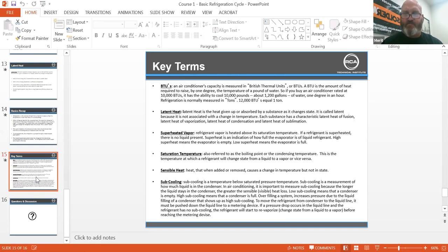What is sublimation? Sublimation is when something goes from a solid to a gas without going through a liquid — it skips the phase. Like with water, water goes from solid to liquid to vapor. With CO2, we'll see sublimation — CO2 goes directly from a solid like a piece of dry ice directly into a vapor without going through the liquid stage at atmospheric pressure. That's something to remember because we're getting into CO2 systems. Jim is working on CO2 certifications, and quite a few guys in the company already have CO2 certs.